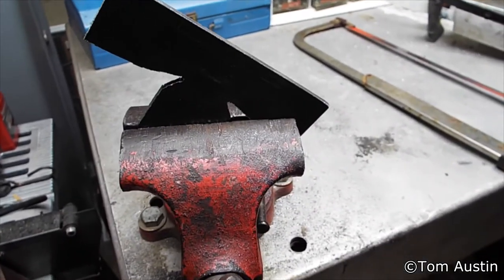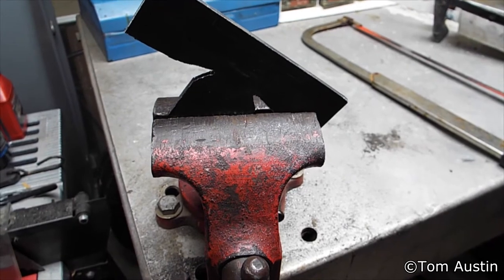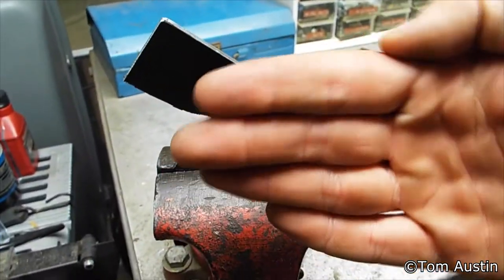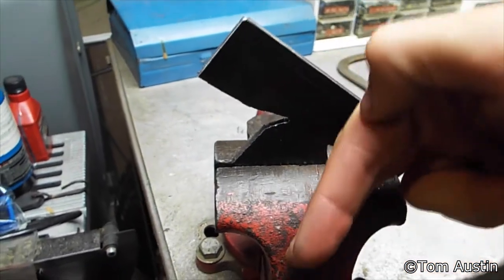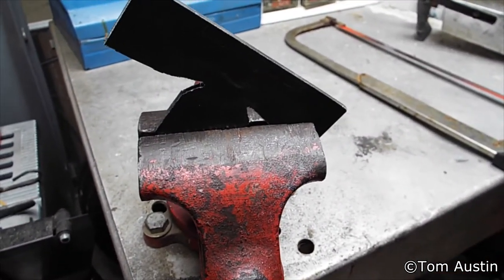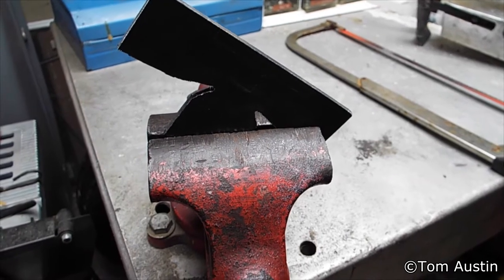Last is the little notch up here. If you don't cut that out, the back of your palm hits the bottom of it and it's just uncomfortable, so it's better to cut it off. This one is a little more hairy, because the best approach involves doing some interesting hacksaw work — cutting various v-notches at progressively shallower angles until you can get the hacksaw flat under it and cut the piece off. Then clean it up with the 1-inch vertical belt sander.